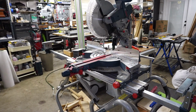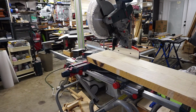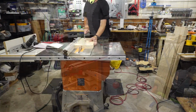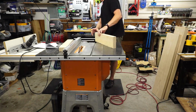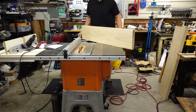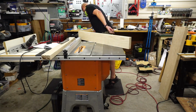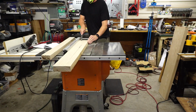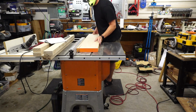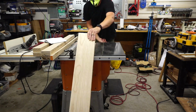First order of business was to break down everything into more manageable parts on the miter saw, and then using the standard roughing process I would move on to the table saw. So next, the table saw took on all these parts to get them closer to final dimension. Here I'm roughing out the 4 legs, the 4 top aprons, and 4 lower stretchers that will not only strengthen the case, but they hold that shelf I pointed out earlier.